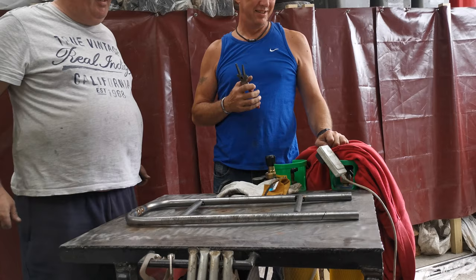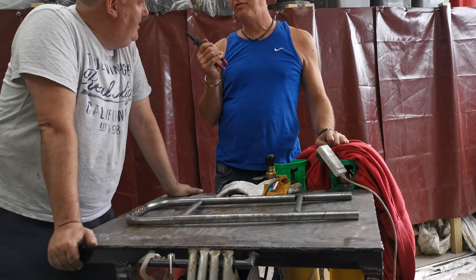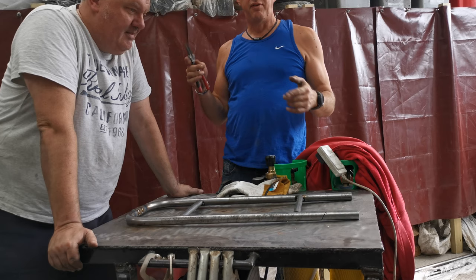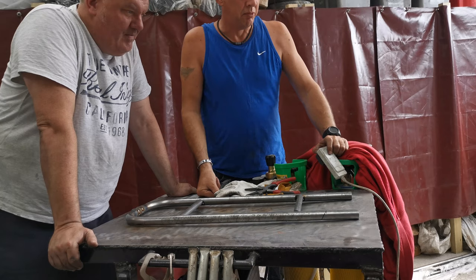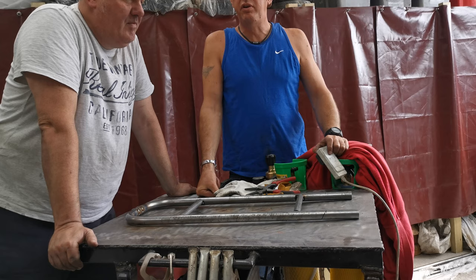This bike has got a breakaway frame. So as you're sitting on the bike, the right hand side of the frame actually comes away, and a supporting member that goes across as well, just a bracing beam. You can unbolt all that, and it's supposed to make it easier to get the engine out. And to be fair, it wasn't too bad. It does weigh an absolute ton. But we've got it out. It's now on a dolly.